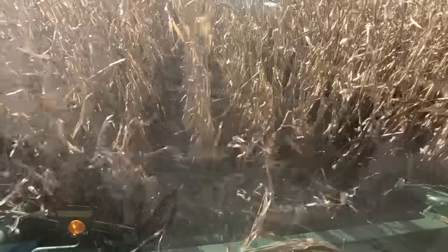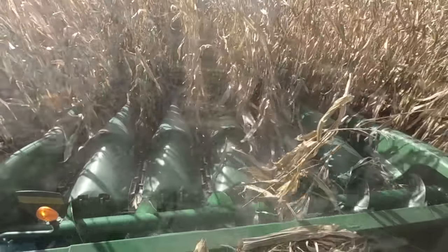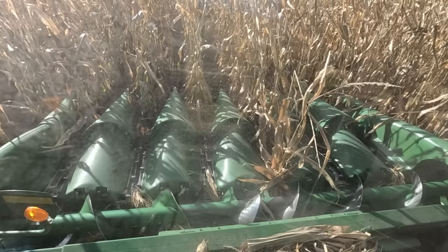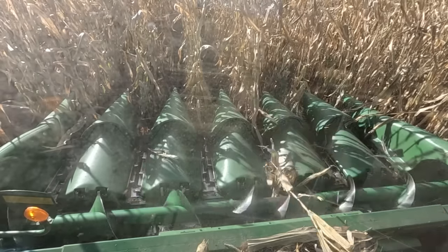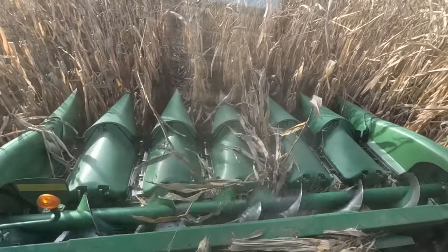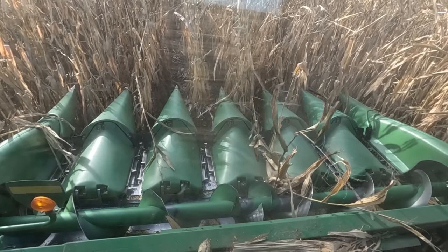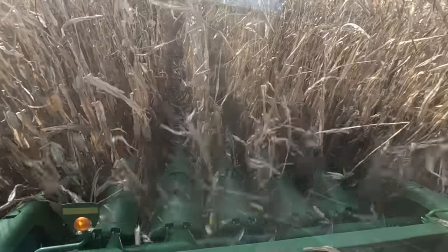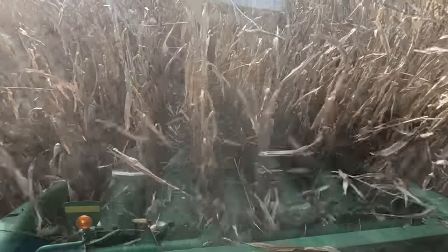As Grant earlier mentioned, the corn head roller in one row was acting up a few days earlier when taking out my end rows. Well, that went away when we were in Gary's corn, and his being drier, there weren't any issues until we switched to mine. With my stuff not being as dried down and the stalks being so tough, the worn out roller started to really struggle and bunch up. To keep the combine moving and not stopping every 10 feet, we increased the header speed, which unfortunately causes a little bit more header loss, and then just slowed down the ground speed of the combine. So it seemed like those were the best two combinations to keep it from bunching up the least amount as possible. And when lifting the header up, you can see how worn out those roller fins are. But I can't complain. We're still moving and yields are better than expected.